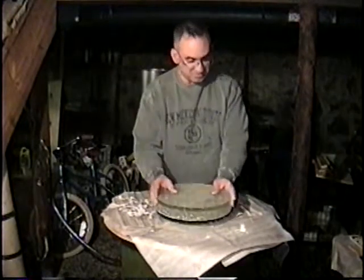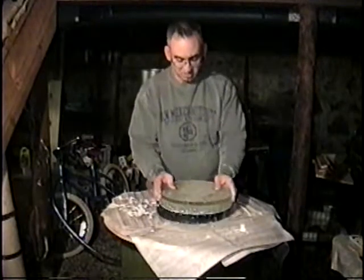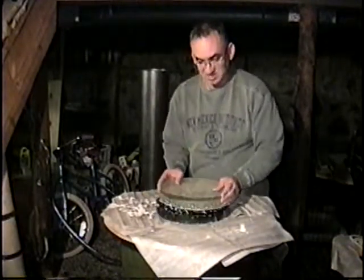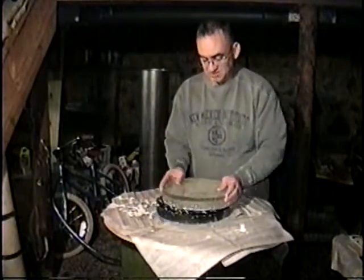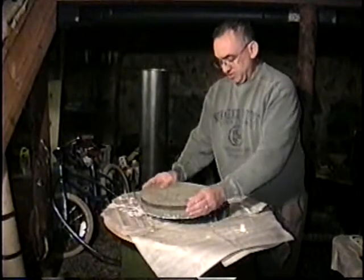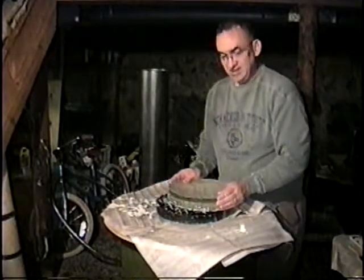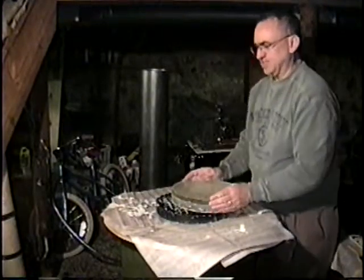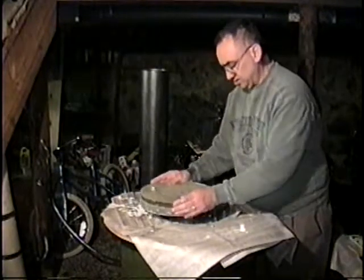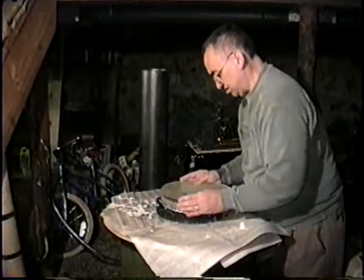Now, really, the numbers of Gugolz are more associated with the melting point or the softening point of the pitch, and they're not even directly related to that. And that's in degrees Celsius, not degrees Fahrenheit. But as a rule of thumb, take the number of the pitch, 51, 64, 73, 80-something, and 91. I think it's 84 and 91. And depending upon the temperature you're going to be working at, that should be the number of the pitch that you're using.